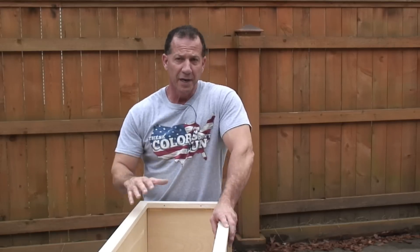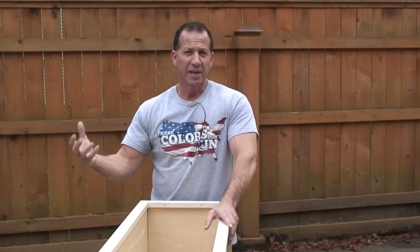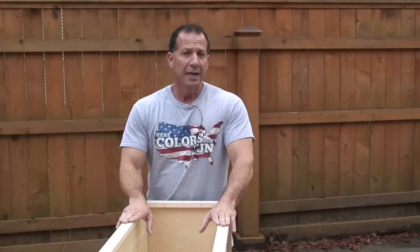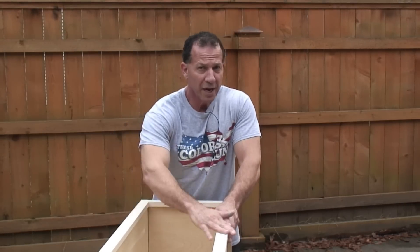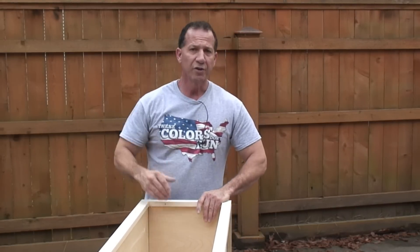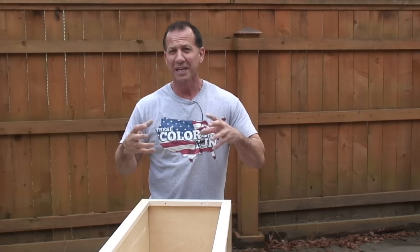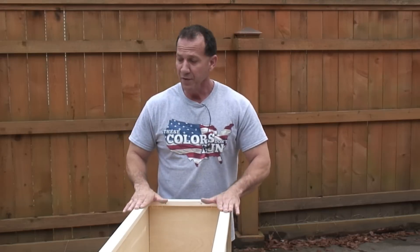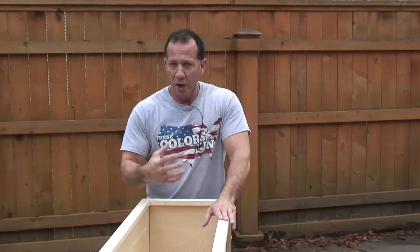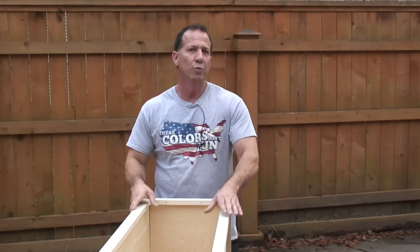Normally I will prime anything that I'm going to paint. That's why I bring my doors outside to prime them — I don't want the fumes in the house. Inside, you can just use sandpaper and knock this down, get it a little bit roughed up. I use 120 grit sandpaper on a vibrating sander and just hit it. You can do that in the house, keep the dust down to a minimum, and then apply this paint and it will stick real well. It sticks better if you have primer on there — it just makes it a little more durable.